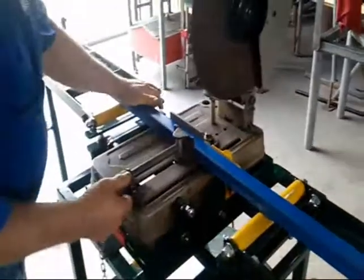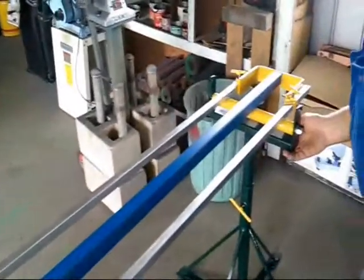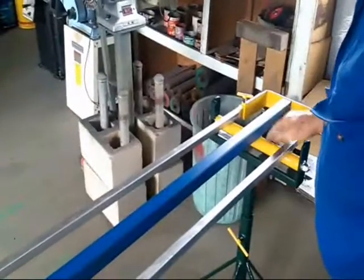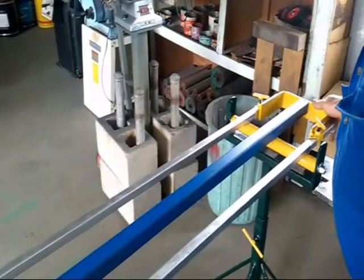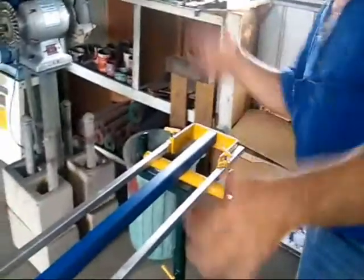And bang. Right. Always, when you're cutting long lengths like that, always have a roller stand here, because you don't want all the weight swinging off of these 2 little brackets. Like that can go down only to there, and if you went out there and didn't have nothing and something dropped them, this would all be buggered up here. Right, well that's the gauge out of the way.